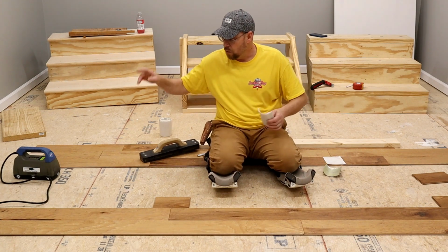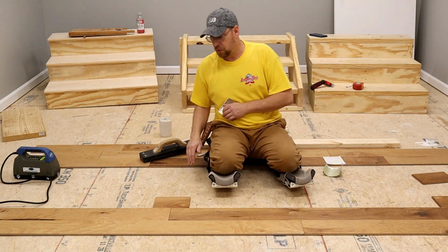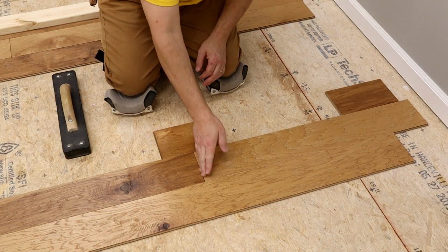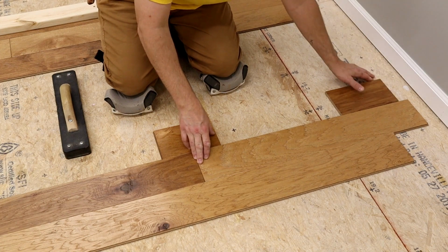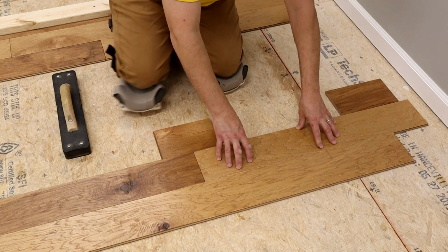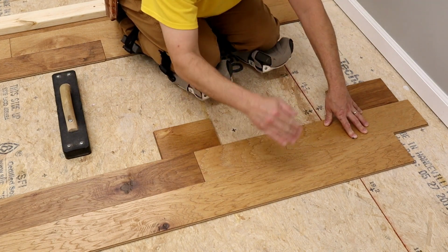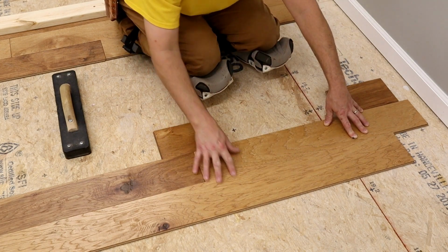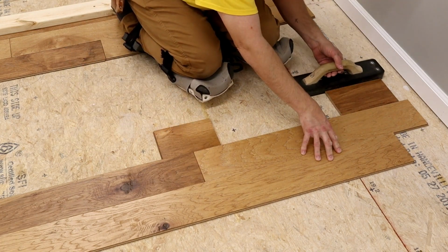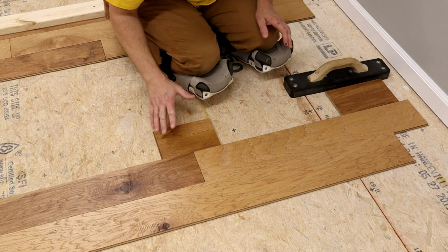I'm going to do this 1 on each end of the boards and 1 on every joint of the board, okay? So if this joint is tied off in the board right here and this end of this board is tied off right there, that's going to allow me to pull or push any amount of pressure I need to get these boards right here together, and so on without this glue down floor moving all over the place, okay? That is the most problematic part of doing a glue down job, is getting started and wrapping around walls, okay?